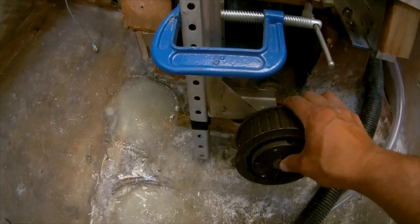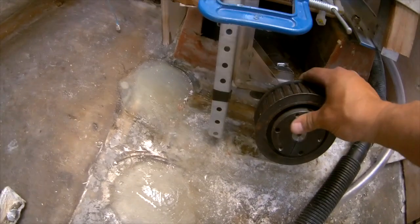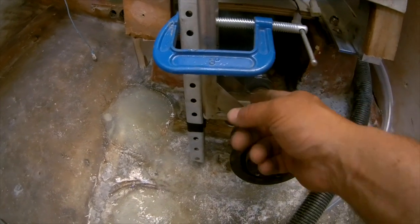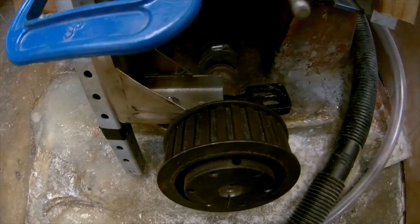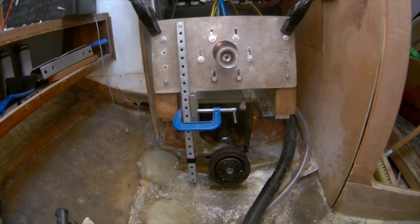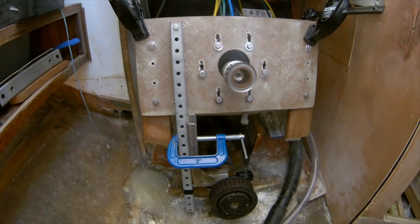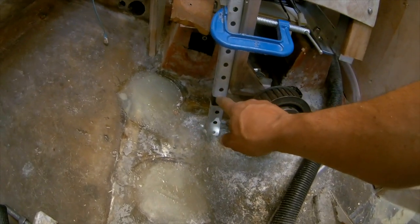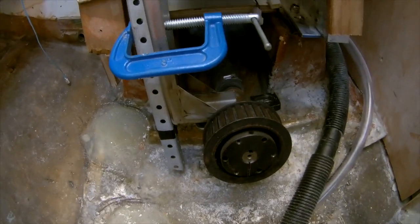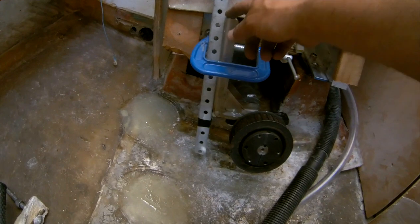I was getting kind of close here with this design. My only mistake was that I made the box channel on the left and right of the motor too short — I basically only gave it a chance to put two pins in, because I had the support bearing kind of inverted. I ended up going with it down, which was just easier to mount things on, but I needed to put three bolts on the left channel and on the right. This design did allow me to actually move the propeller shaft left or right or up or down, and I used the collars to give me my Z-axis of forward to back, and it got me very close. I just needed to extend those box channels.